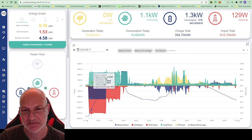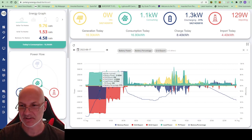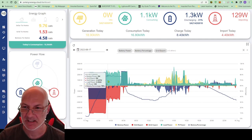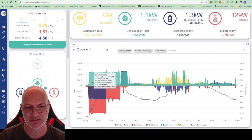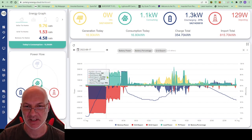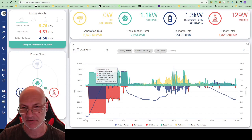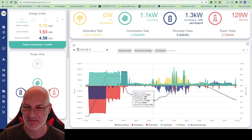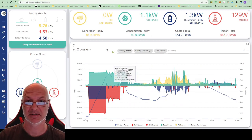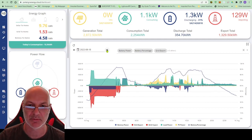This one sums it up — and this is where you can make life very complicated, especially using a three-pin charger trying to get the most out of it. On a relatively sunny day I tried to charge the battery up as much as possible — up to about 80 percent — then use no battery for the remaining time up to 5:30. At that point I set a timer to discharge the battery to give some power back, and then the solar should recharge the battery, which was the theory.